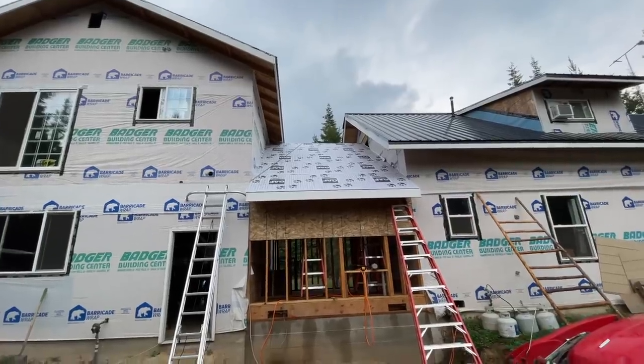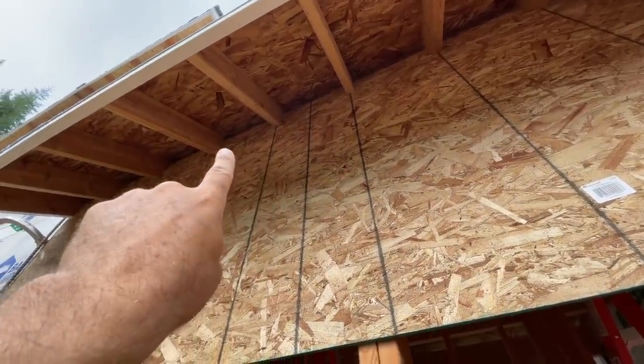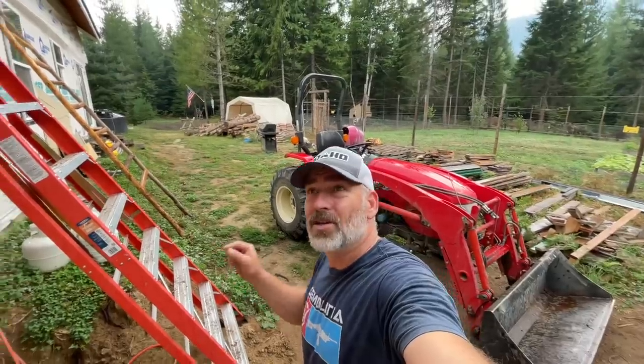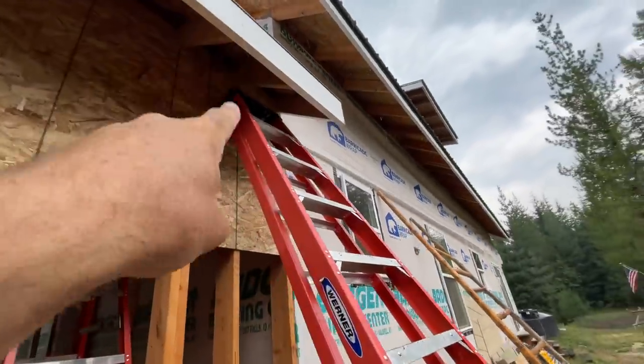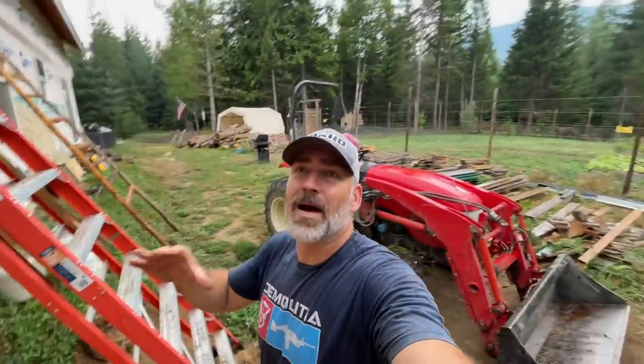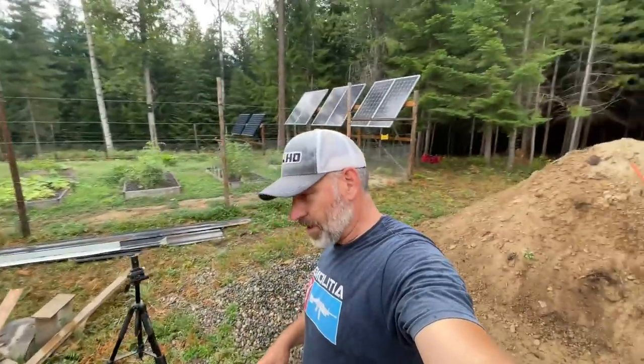That wasn't the first time ever, just the first attempt this time — it's hard to get those things to line up perfectly the very first time. You guys were talking about the rafter tails and how you're concerned there's not enough left because the bird's mouth was so deep. We've got about two inches of rafter tail left from the bird's mouth. We do have a two-by-eight fascia connected all the way across, and hopefully that two-by-eight will spread out the load when snow falls from this roof. The OSB is nailed on really good, every six inches, so hopefully that ties it all together and spreads the load. Guess we'll find out this winter — there could be a lot of people joining the 'I told you so' club.